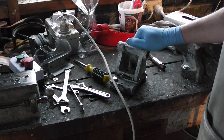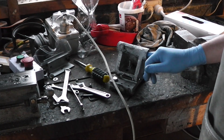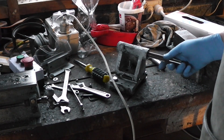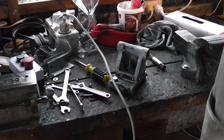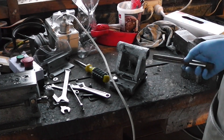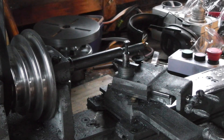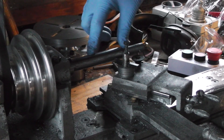This bore is slightly over 16mm because even with the best drill in the world, a drilled hole is going to be slightly bigger than the drill bit. And when it wasn't the best drilling — I did this freehand with an electric drill going wobble, wobble, wobble — that's why the 16mm wiggles. So instead I'm going to bore it, since boring is a lot more accurate. Once I've got it approaching 20mm, I'll put the reamer in and scrape it out to 20mm. But first I need to thin out this part of the boring bar so it will reach through the entire unfinished bore.